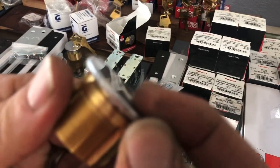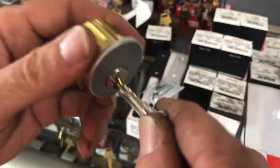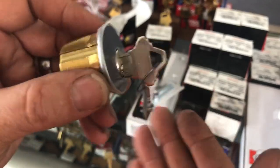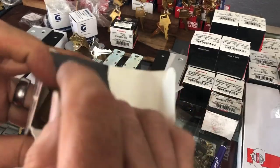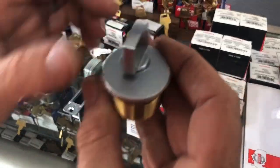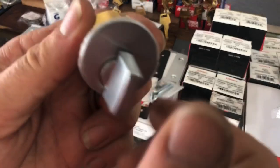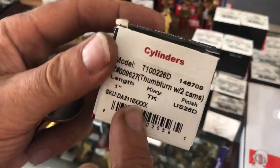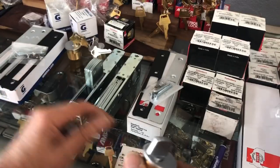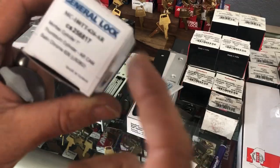With the LSDA cylinder, we open it up and see a cardboard separator — no plastic bags — and a plastic face to protect the finish. This is a one-inch cylinder, which won't work for a six-pin key but works fine for five-pin, which most storefronts use. The thumb turn also has a little plastic face on it that can catch when you peel it off — just a minor annoyance. When you call up Acme and say you want a thumb turn, this standard one is what you'll get.